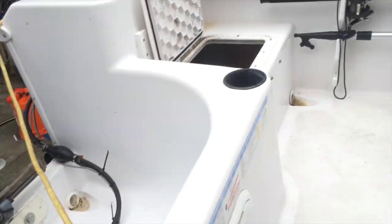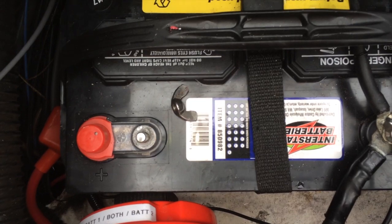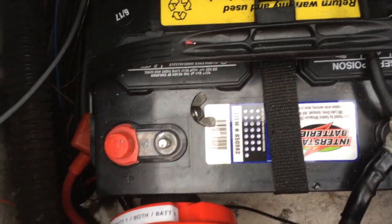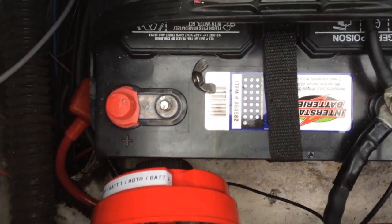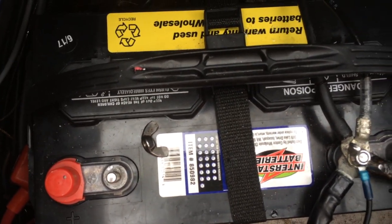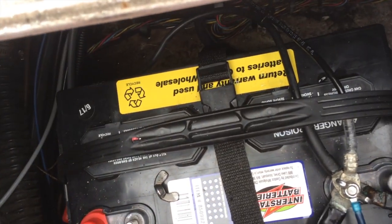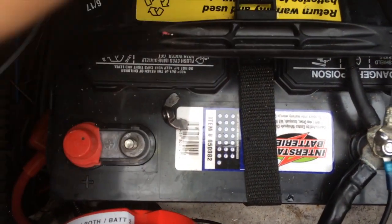I have two batteries on the boat — one over there, one over here. I got to thinking the amplifier can never really be shut off. So even if I turn this to off, which I do when I store the boat for more than a day, the amplifier is still attached to the battery, so there's still a little parasitic draw. I know because when I attach the amplifier wire to the battery there's a little spark.